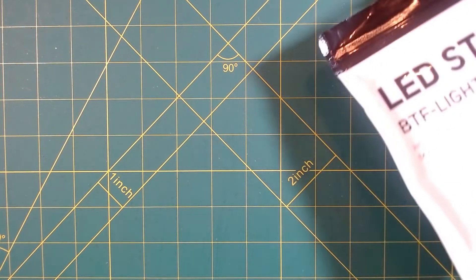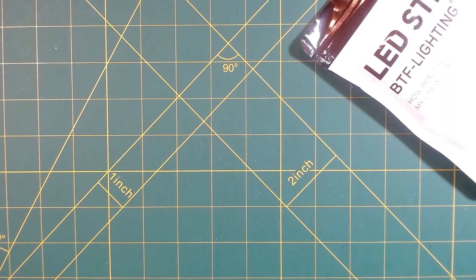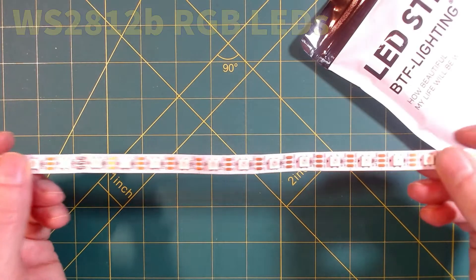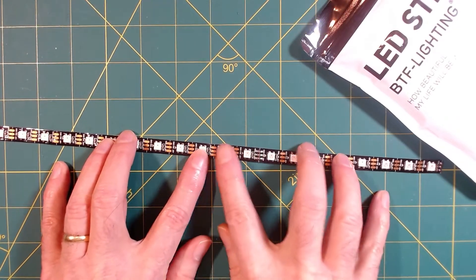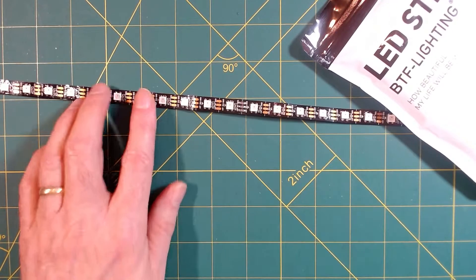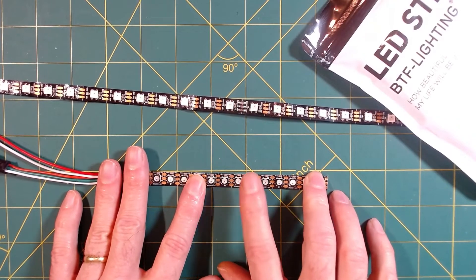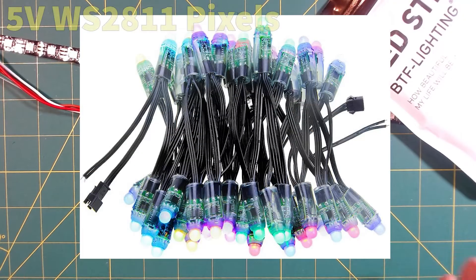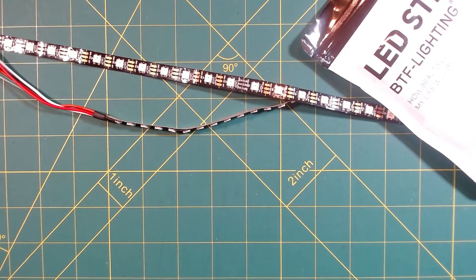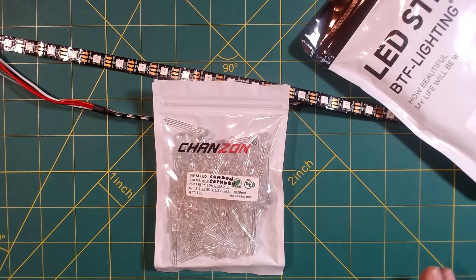Let's move on to LED strip lighting, since most of my projects involve that. I like to use BTF LED strips — they are not a sponsor, but I found they are always good quality. These come in all sorts of flavors and options: white or black background, one meter or five meter lengths, and you can cut them to any size. They come in different pixel densities — 60 pixels per meter, 30, or 144. These are RGB, but if you want true white, you can move up to the SK6812, which includes a separate white chip. They also come in a bullet pixel style, or you can go with individual RGB pixels and build your own.